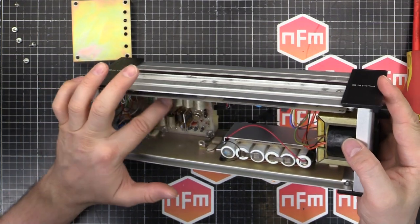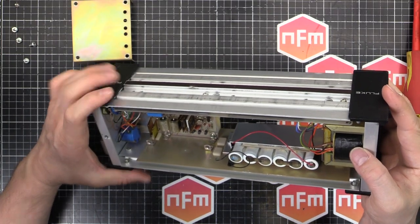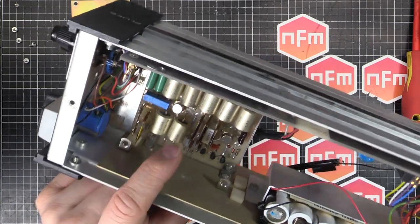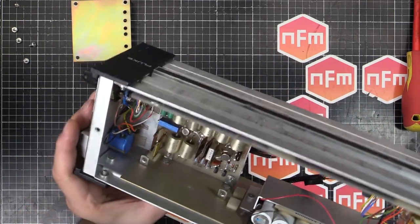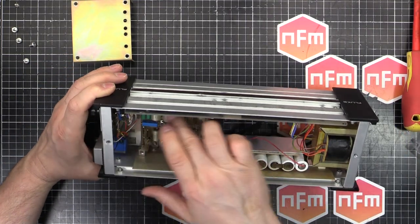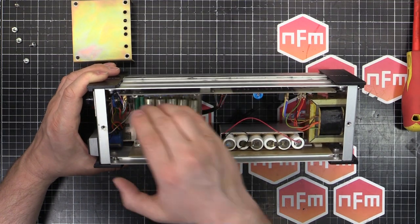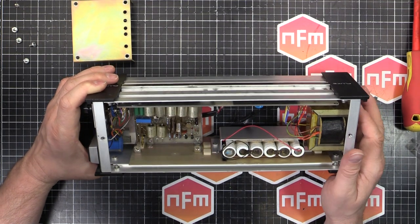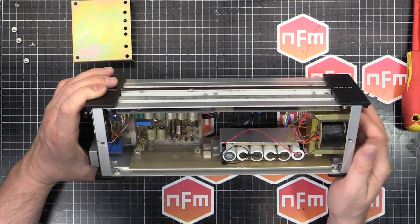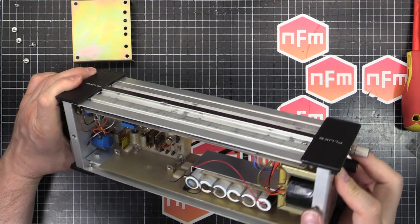But the rest of them look like they're relatively decent low temperature coefficient resistors. These are the blue ones down in there. There's some green ones up there. The money shot right there. If these ones burn out, good luck getting them, because I believe they're done in matched pairs as well, a few of them. So you don't want to go messing around with them too much. 0.05%. Yeah, and they're low temperature coefficient, super accurate.